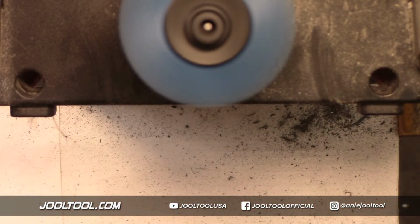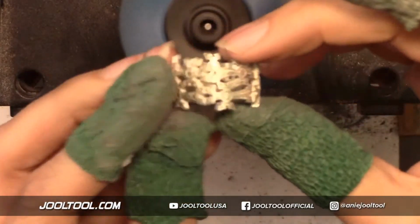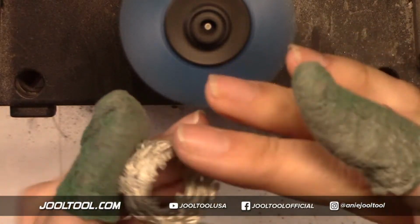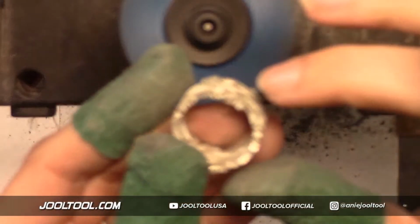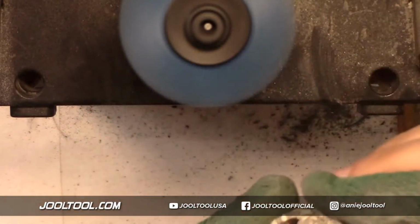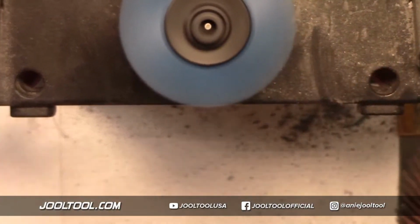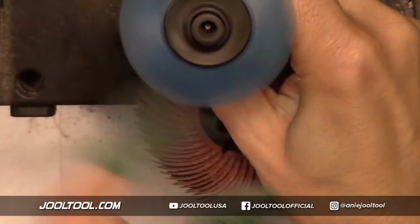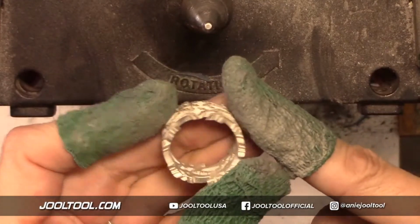Vonik asked me a good question: what if I want to get rid of the sharp edges, just dull them slightly? The easiest way is, you can do two things. If it's specific ones, use the Scotch-Brite because then you can pinpoint. Or you can use a heavier brush. Vaughn, you got to turn it off first. So you can whack it with the 220. But Vonik, I would save removing all of those till later.